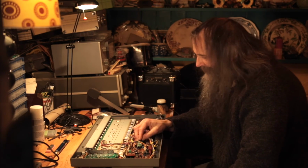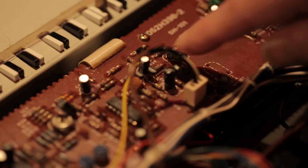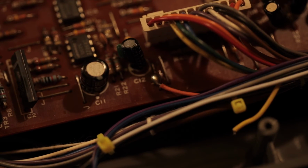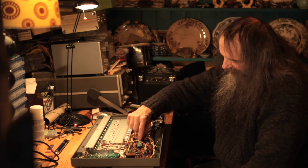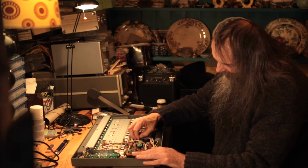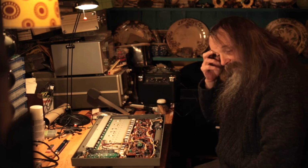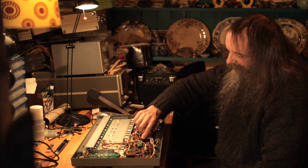Apart from that, there's just 4 wires to solder. There's one that goes onto the board under there. One attaches to this transistor here. One there and one over here. So there's just 4 little wires to connect. Those will come on these neat little plugs that just plug on here, like that, so they then just go on to the end of your chip. It also comes with fully wired up MIDI in and out sockets that just slot on there.